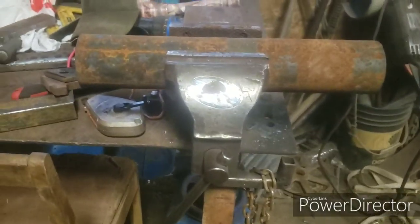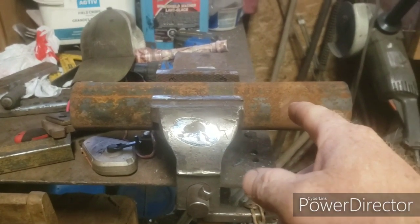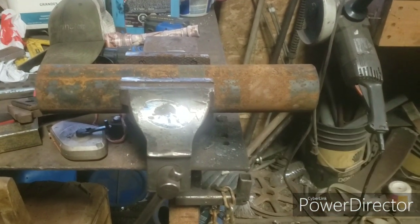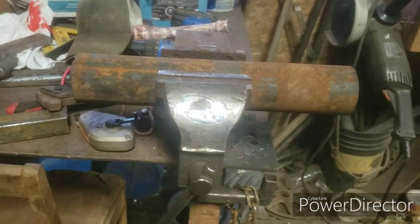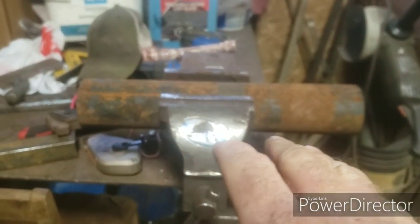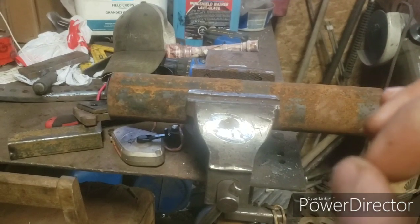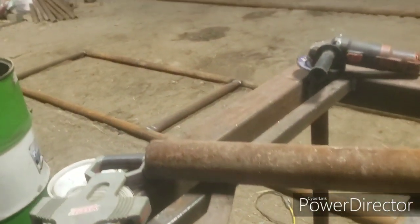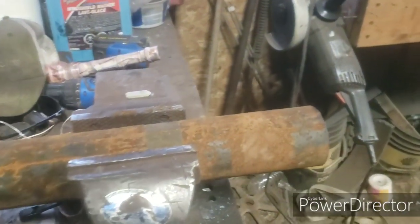But so basically coming to this point to get to cutting the feet and that on for the 6 foot legs and the feet and that, I'm about an hour and a half to get to this point. Before, when I was saddle cutting all the pipes, I would be at least 3 hours, 3.5 hours, probably by the time I could build a whole one. And I'm only probably, I don't know, maybe an hour away. So I'm gonna cut it probably in half by using the old press here, squishing the pipe. So that's a big savings.